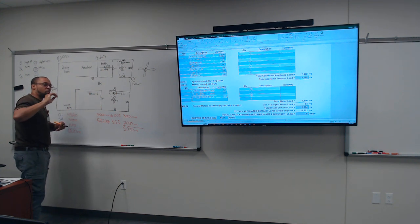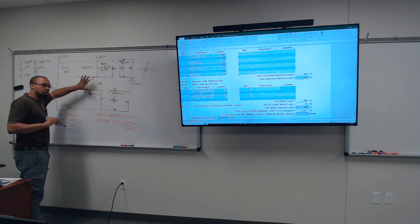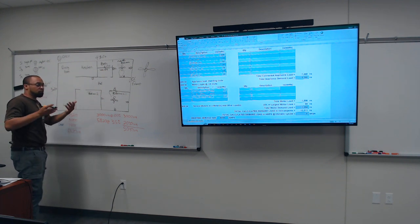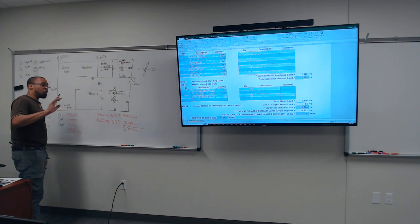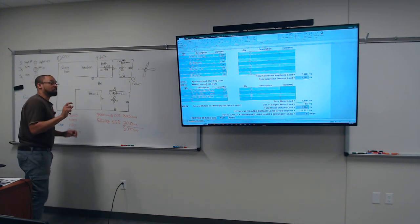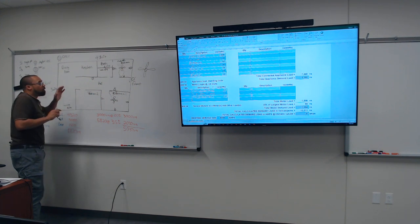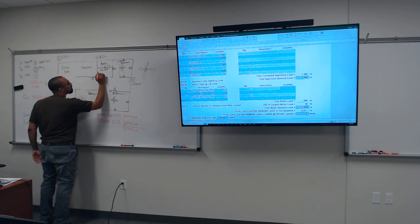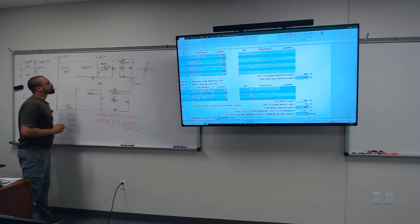We're gonna actually go over what size dryer can go in there, but we're gonna install the 240 receptacle for the dryer. But we're not gonna do the laundry load, because you might get an 8,000 watt dryer, you might get a 10,000 watt dryer. The load calculation, we're gonna figure that out next week. But for the purpose of the 240 plug, we're gonna do that now. All right, so since we're in there, let's go ahead and put that in there. So the dryer plug is going to go here with three lines.